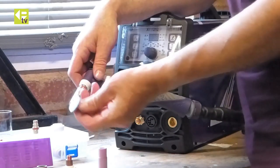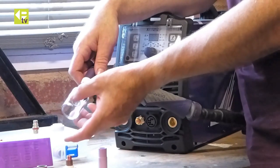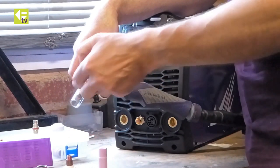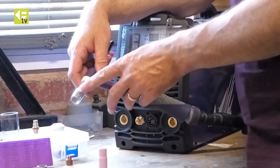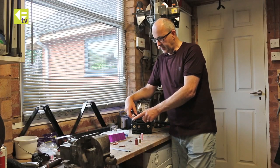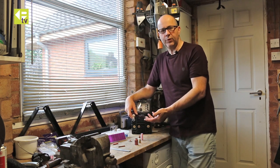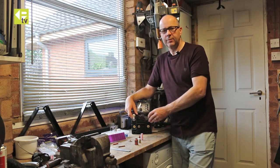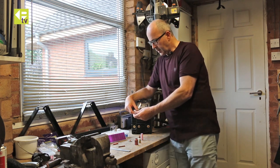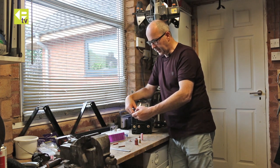There's a larger series available — this is a larger gas lens front end and you can see a much larger cup you can put on there. Obviously it uses a different holder, but the limitation is there's not that many different sizes of cups available, so you're limited in what you can do with them. They do have the advantage of improving your gas coverage and allowing you to generally turn the gas down by probably around 10 to 15 percent reduction in gas consumption.